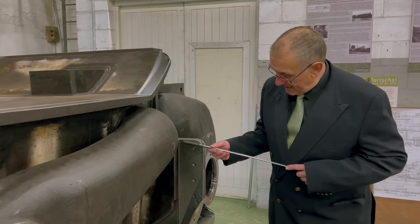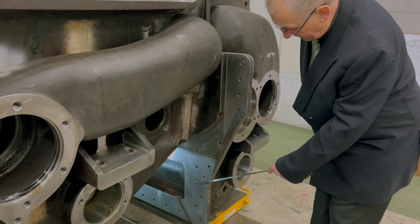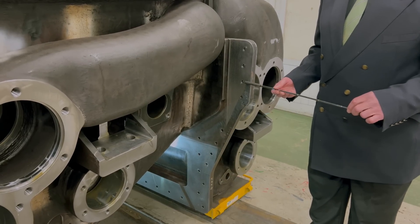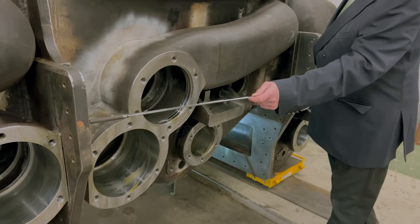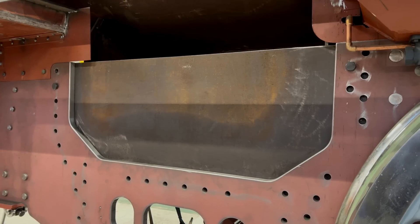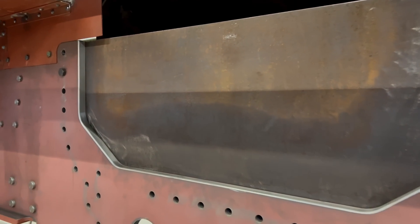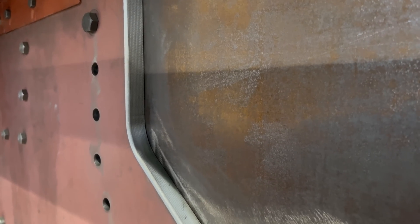You will see here that some machining has been going on. This is Howco's preliminary machining of this face, which ultimately has to be set so that from there across to here — its opposite number — is precisely the right distance for the distance on the outside of the frames. As you can see, we already have the cutouts in the frames, which were accurately CNC machined when the frame plates were machined and drilled right back in the early days.